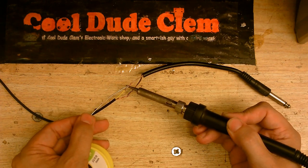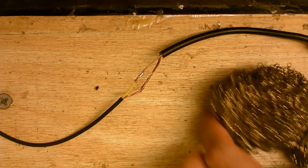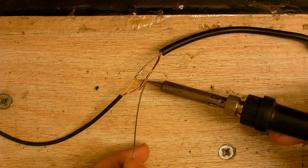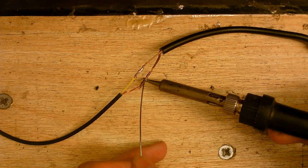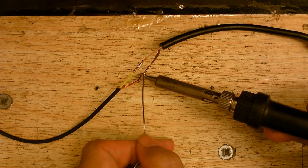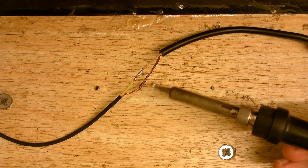See how awkward this is being? It's just not flowing onto the wire. Now you can see a close-up of the intense soldering action. I'm going to clean the soldering iron tip — it's always a good idea. I'll tin it. See, solder flows nicely onto the tip, but it does not flow onto what you're soldering. It is just absolutely refusing to coat the wire. I've never had this much difficulty soldering two wires together in my life. Just look how much solder is bunched up on the tip there instead of flowing onto the wire like it was supposed to.